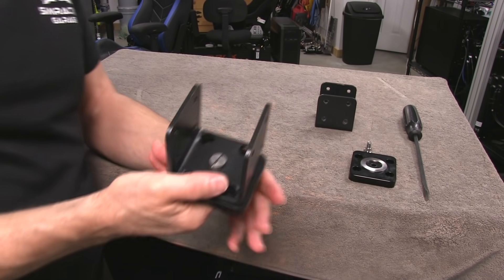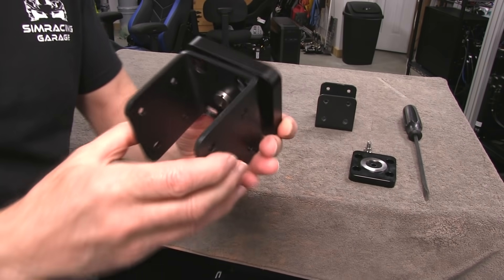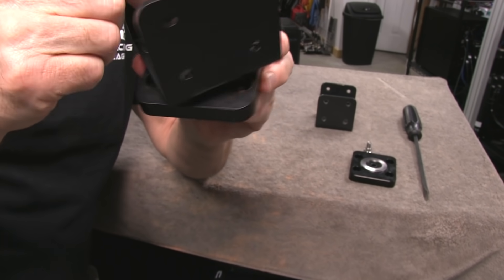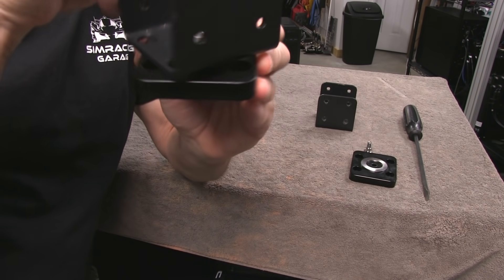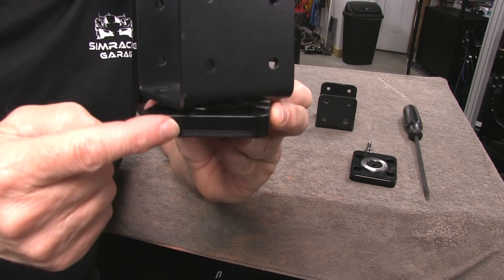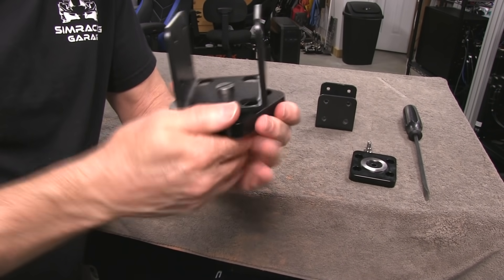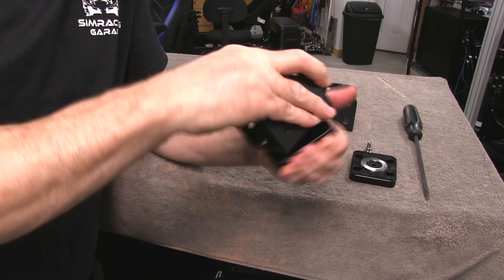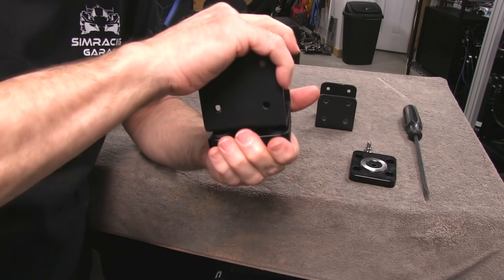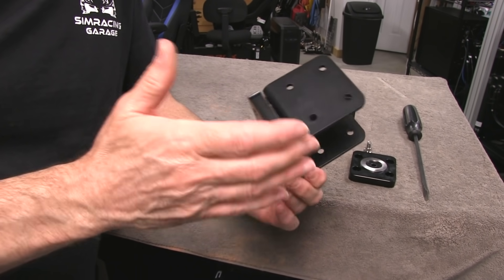He's changed to a different system. This one has a sealed bearing pressed into it. It's harder to move but it still moves, just a little bit stiffer. There's hardly any lash in this at all when you push it back and forth — nothing going on here. I think that's going to cure the knocking sound we were getting out of this bracket, no doubt.